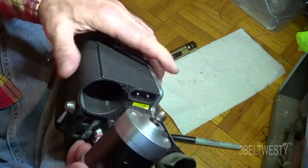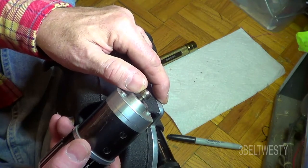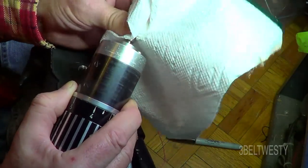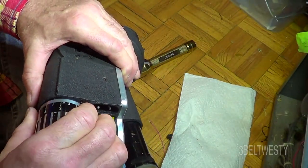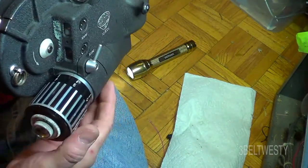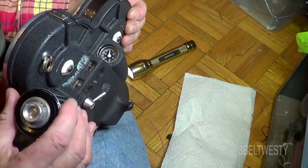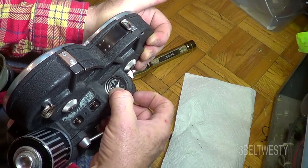When you're putting this in, this little thing is going into the rubber piece, so you really want this fairly dry — no oil or anything that's going to spin inside the rubber piece. If you've been handling it, it's wise to clean off the crud so it'll grab the rubber better. It's flush and locked. When you load film, set it to a slower position so you can make sure the film is advancing. You don't need to go full bore. Vary it to set 24 frames — there's the red mark right there for 24.